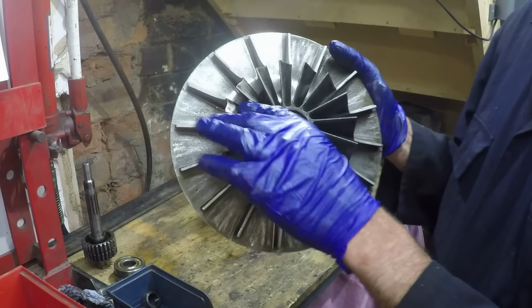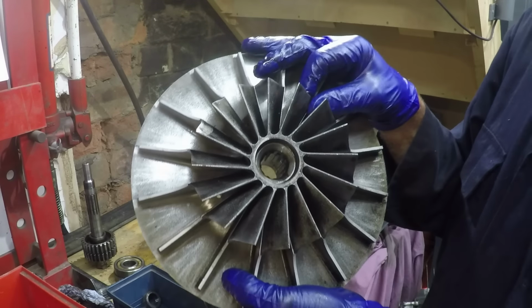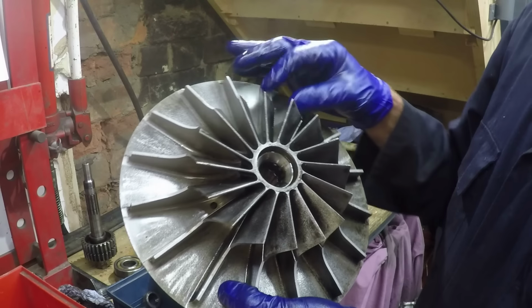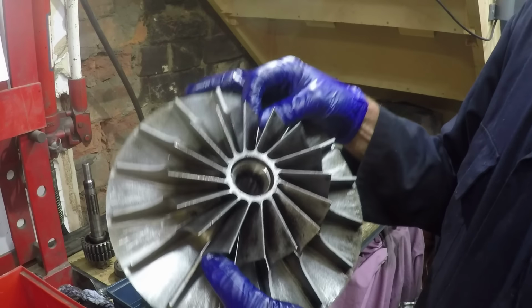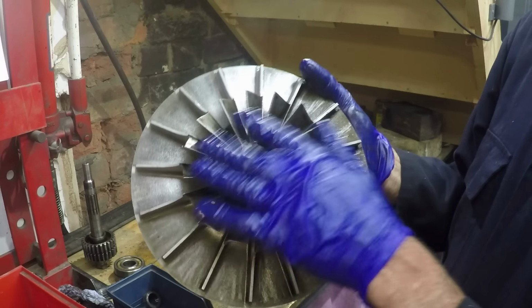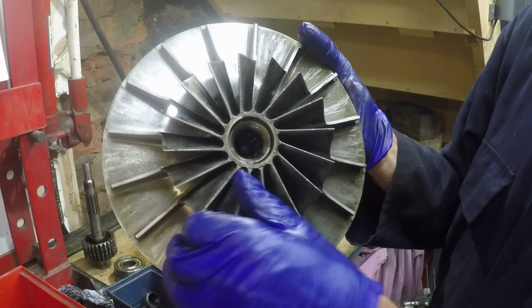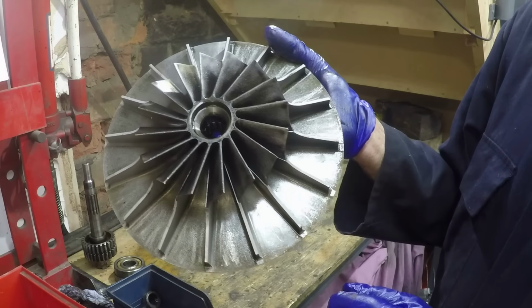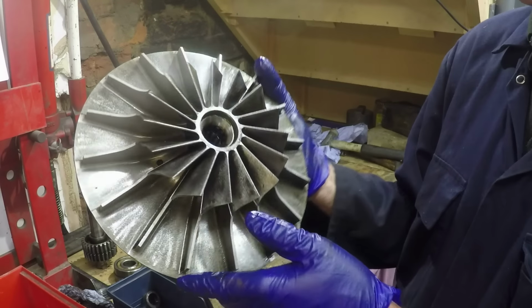The sort of rusty colour of this thing, this rotating guide vane, is because they were never plated. Most parts on the engine had zinc plating or other types of plating on them, but they didn't do it with these. Possibly on the basis that it was getting oiled by the tail bearing. I don't know, not honestly sure. Because actually, you would think that it would have a lot of water coming at it all the time, but they obviously didn't worry about that.